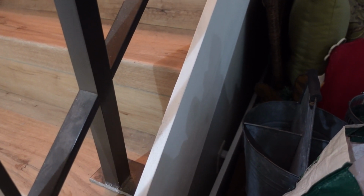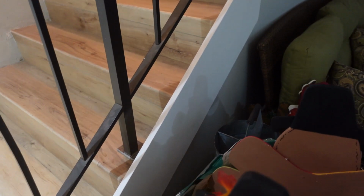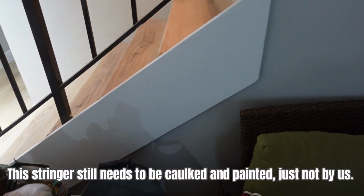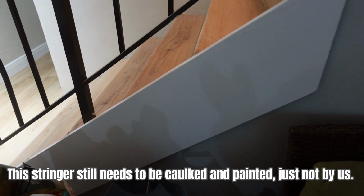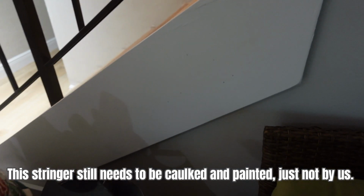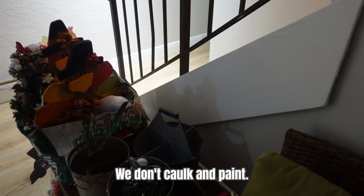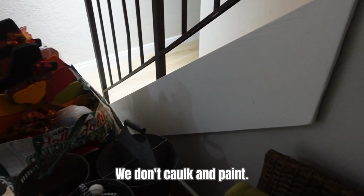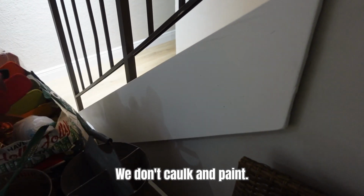Now I get homeowners all the time that ask me, how do I finish off my floor? Do I have to put stairnose all the way around here? I'll go to jobs where people have tried to do the stairs themselves. I'll see all kind of baseboard on the outside or L caps, all kind of weird stuff I've seen companies even do. But the simplest and easiest way to really finish your staircase off nice when it's open and you want to put vinyl is to put a stringer. The stringer dresses it up and it solves the problem of having an open side.